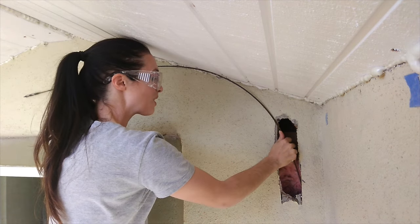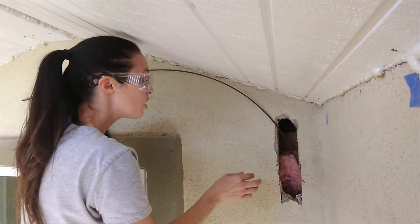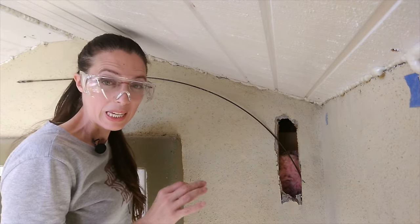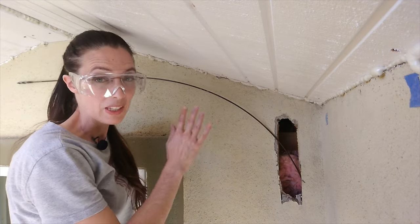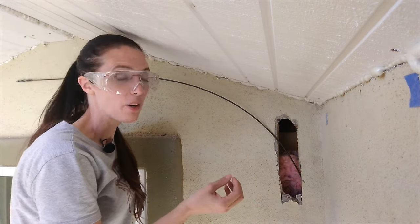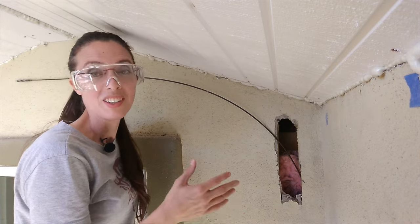Push as hard as you can horizontally, as you saw in the mock-up, which pushes the drill bit straight down. Once the drill is in place, work in short spurts. This prevents heat buildup and gives you feedback — you can tell whether you're going through something hard like a stud or something soft like drywall.